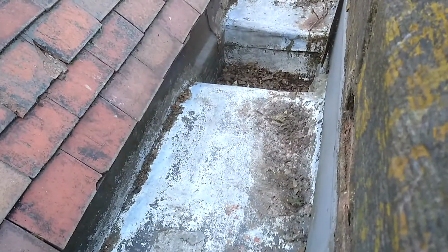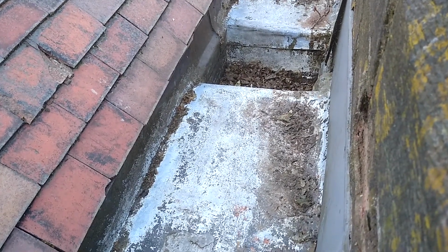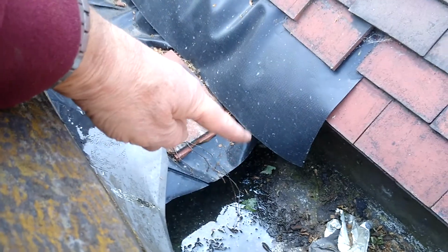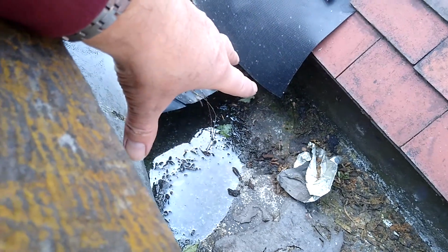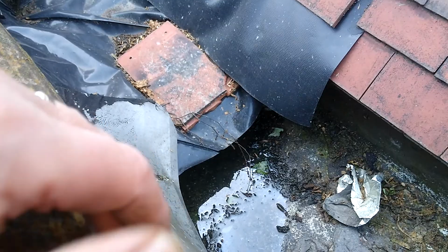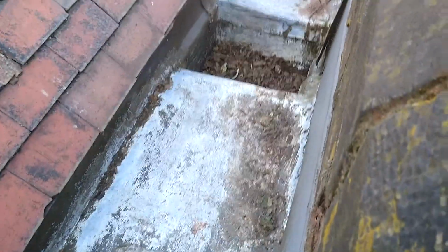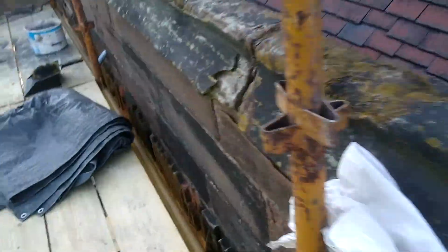This is basically the extent of the damage here to that gully there. The gully is sound to there, and just here is where the collapse starts. There's our temporary repair beginning here, and you can see there's a big pool of water there, which means that's collapsed. It's not coming in for whatever reason, but there's a timber collapse underneath there. So the lifting of all the timbers and replacements, at a guess, is going to be probably from there up to about here. So that's the structural repairs, extending that sort of distance, probably a little bit under 10 metres.